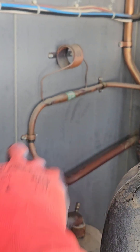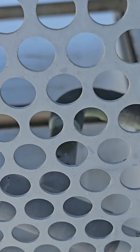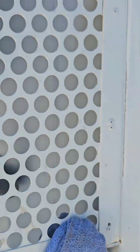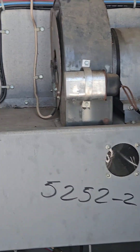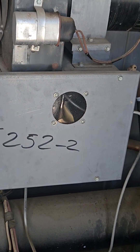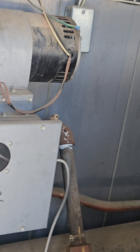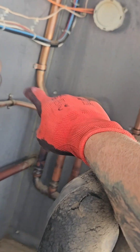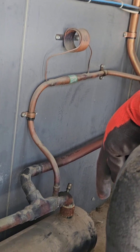And that's the ORD valve, and the other side of it is right here. You see - it's got the receiver. It's got a Maxitrol, so it's got modulating gas heat. There's where it injects. On the ORD, it injects discharge into the receiver.